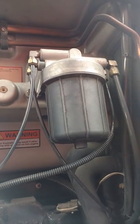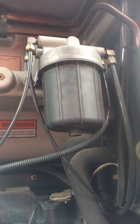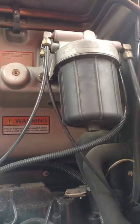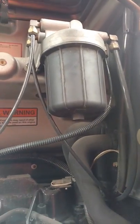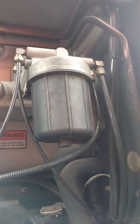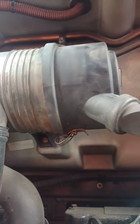Here's the fuel filter — that is the main fuel filter. There's also a small fuel filter beside the fuel tank up under the reefer unit with a smaller screen in there. That's something you want to keep an eye on, especially in the wintertime — you want to make sure that thing doesn't gel up if you don't have your winterizer in there.